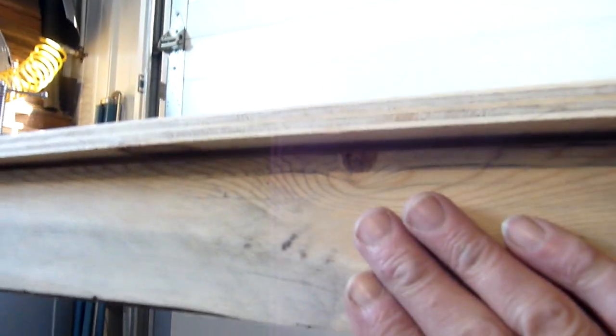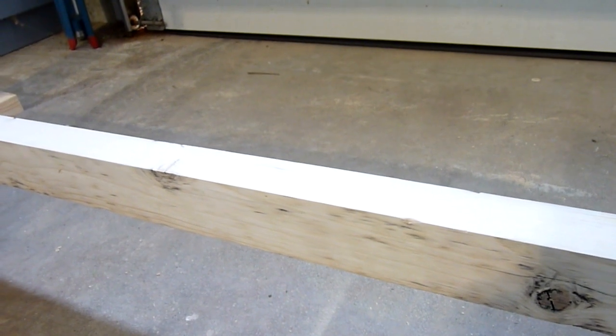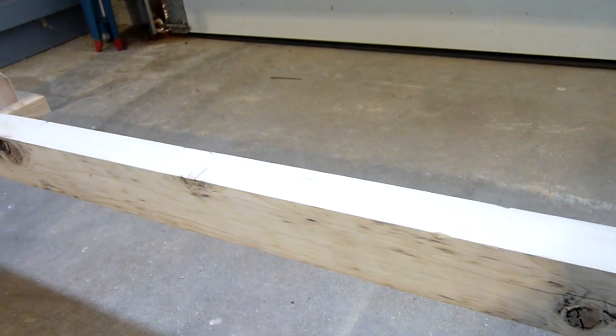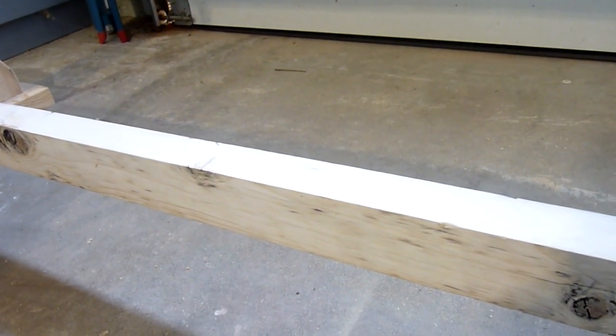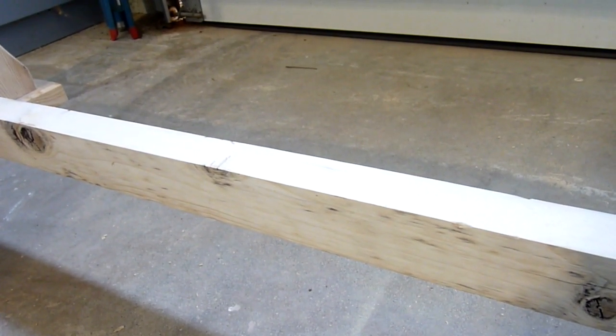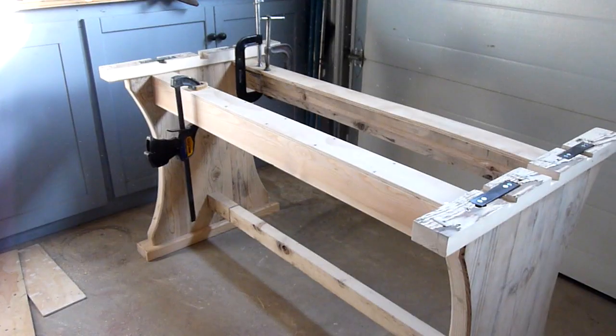So I have one piece cut for here and the outside edge on the other side. And then, because of the dimensions of the wood, I have the two pieces for this cut. And now I have to do the top. So I'm going to use 1/2 inch plywood for that as well, and we'll just stain everything. I'm going to make a recess within the 3/4 inch to hold the plywood, and then I'll screw it down. I haven't decided yet if I'm going to fill the screws, countersink them, or exactly how I'm going to hold it together, but I'll cross that bridge in a minute.